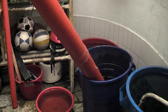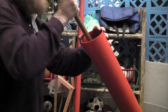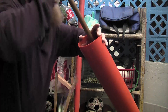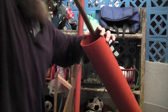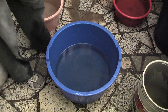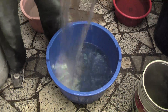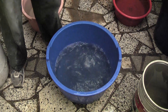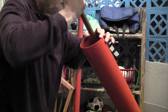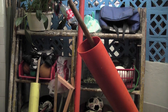Now to test it, I am going to put it in this barrel and plunge it down. It is quite heavy — that is a fair weight of water because it is a 4-inch pipe, but it does shift quite a volume over a reasonably short distance. Now I am lifting that water about a meter and a half.